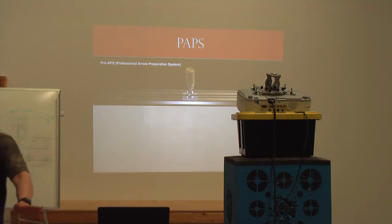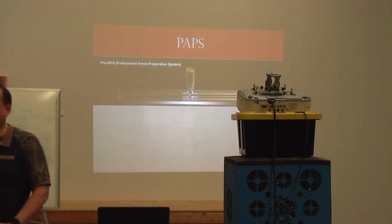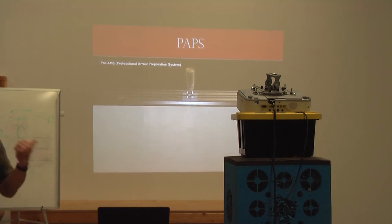I mean, just like when you drop a piece of oil on a table and then slide it, the oil won't move. But when you tap the table, the oil moves. Am I right? So what's changed? I'm actually inserting energy into the shaft. That's the reason right up there is an old Motorola vibration module, like you saw. I put one of those in there and put a brass on it. So when you press the button, there's energy going through the entire brass into the entire system. What it does is lower the initial friction. So when you roll the shaft, you can feel the difference.